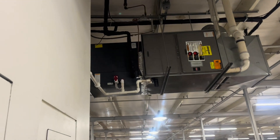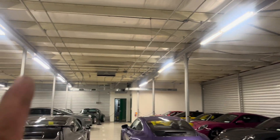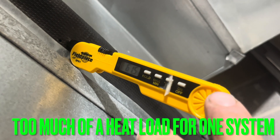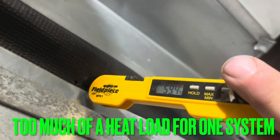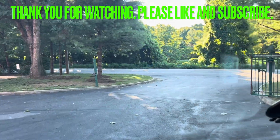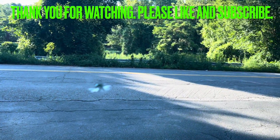This Amana/Goodman is flat up there on the roof, so they'll have to address that. That unit they say is not cooling, but I think it's just not keeping up because that other one isn't running. Let's see — this one is cooling. I'll take the return temp. He's cooling; he just can't keep up with the other unit down. I'll go check the condenser coil outside too to make sure it's clean and removing enough heat, but you've got 60 degrees — this thing's cooling properly. The coil outside was pretty dirty so I cleaned it with a hose and it's discharging heat properly. That system is running all on its own pretty much.